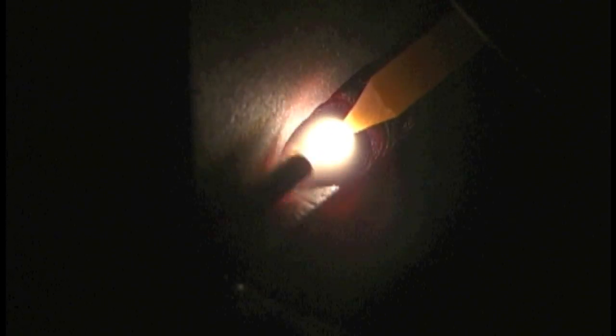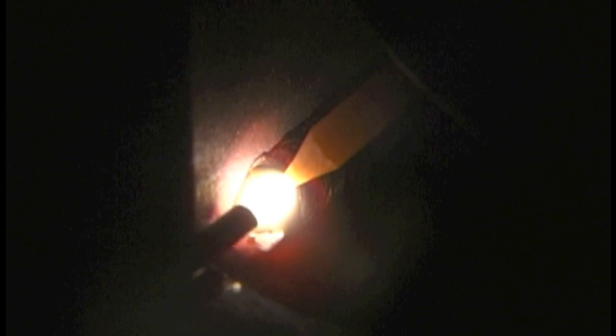Here's a little lap joint, and for the most part on that first weld I went full pedal at 120 amps. I backed off a little bit here, probably using somewhere around 105 amps. A little lap joint like this when you're going nice and slow working around the camera, you can't always handle full amps, so I backed it off a little bit knowing I'd be going a little slower.